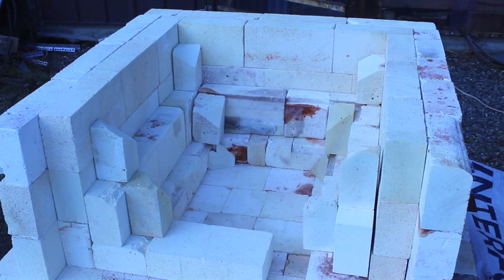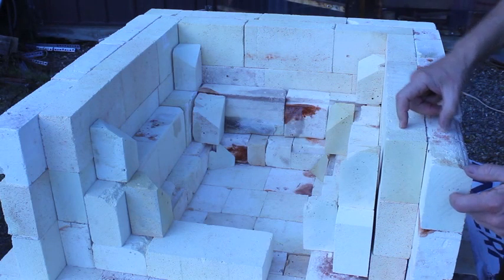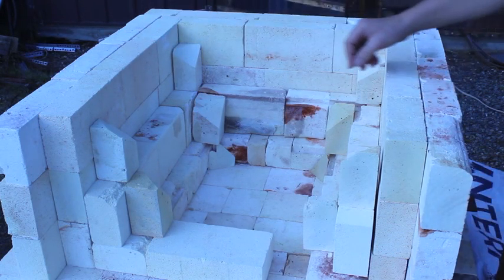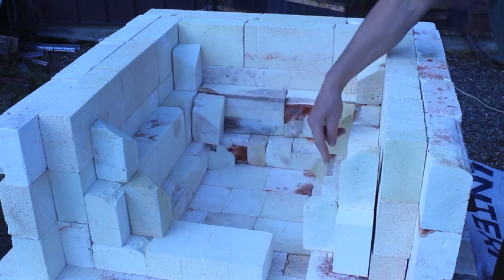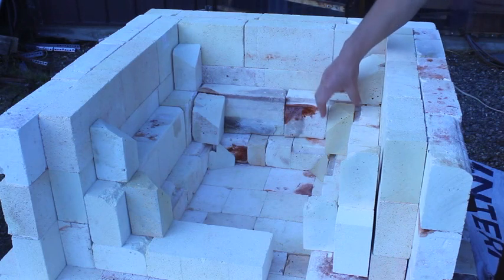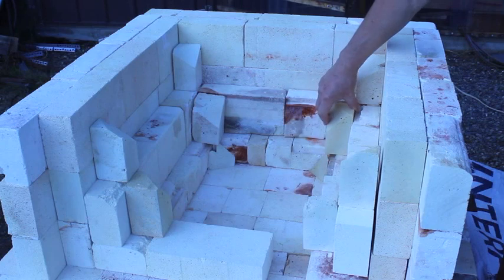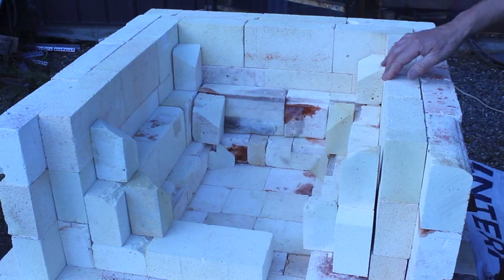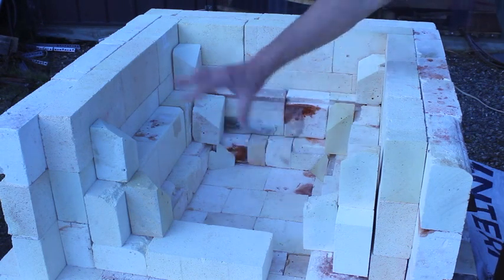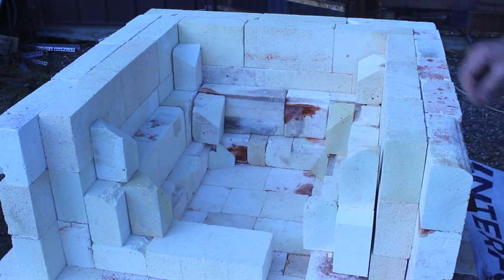This is what I got done on the first day: two courses of bricks, three courses high of K23s around here. I cut the corners and put in some filler material with some crappy bricks, because every little bit of investment material I can displace with a lighter volume material means less mass - so I'm saving energy because I'm not heating up as much mass. I did it the first couple of times too, but this time I added even more than last time.